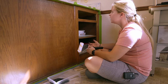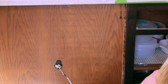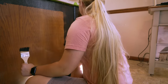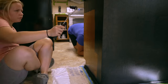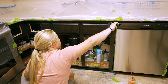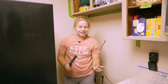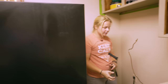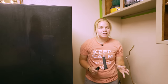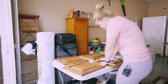Just keeping that in mind when you're using the paint — basically what I've been doing is going over all the flat areas with my roller and then coming back in stippling the areas where it's kind of raised or there's more detail. Remember that stippling motion is just quick up and down motions. Beyond Paint recommends that you don't actually use your brush in a brush motion, but that you stipple, and then once I'm done stippling I'll go over it with my roller one more time to even it all up. Make sure you get in all the nooks and crannies — pull out your fridge, paint everywhere that can be seen and even that can't be seen. Now we're ready for linen on the backs of the cabinet doors out in the garage.